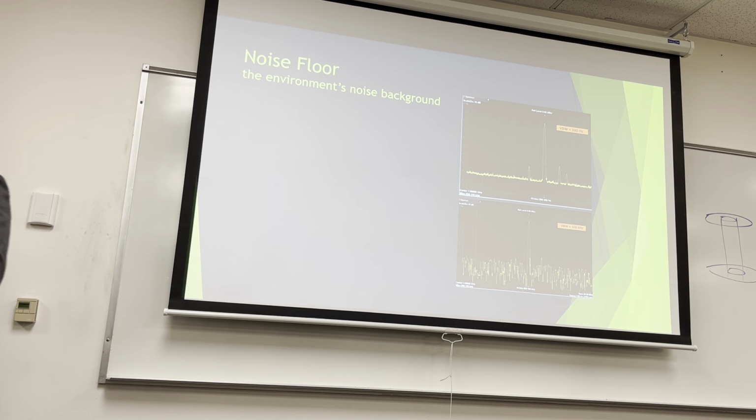So a lot of times in radio signaling, when we're trying to recover a really weak signal, let's say like GPS. GPS comes from outer space, literally, and it comes in at a negative 154-ish dBm, which is, there's not even a name for that in voltage or watts.